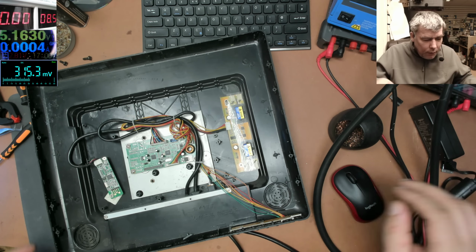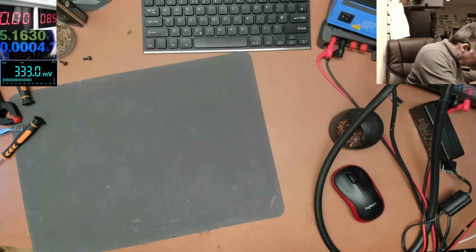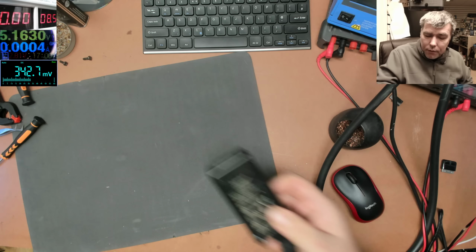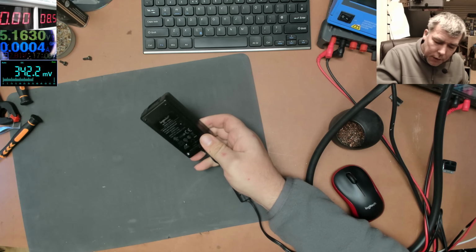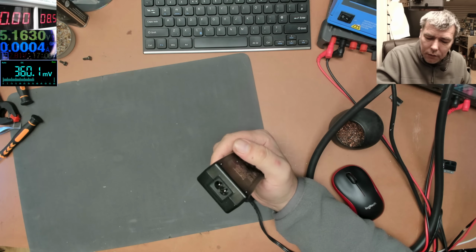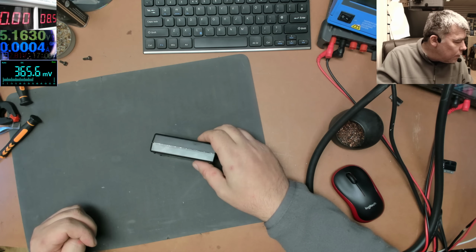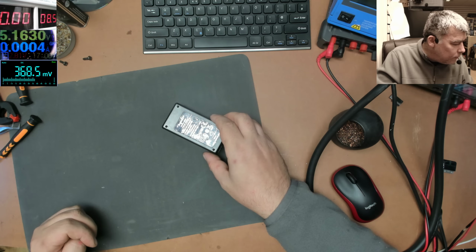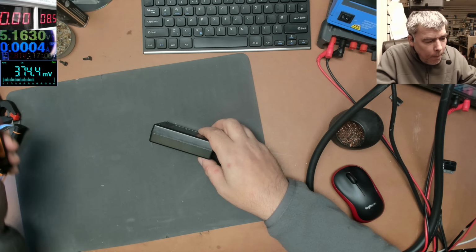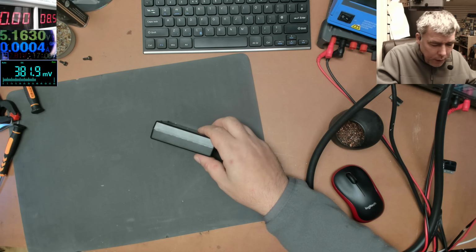So you know what I think? I think our monitor is good. I think actually the problem is the charger. I think indeed it's working with 8 volts. But this is faulty. It's an unusual voltage, 8 volts, 3.6 amps. How can we fix this? I'm sure probably inside we have dried capacitors.